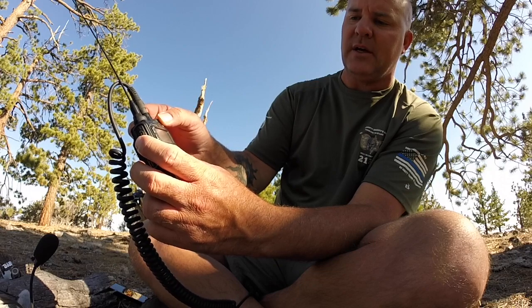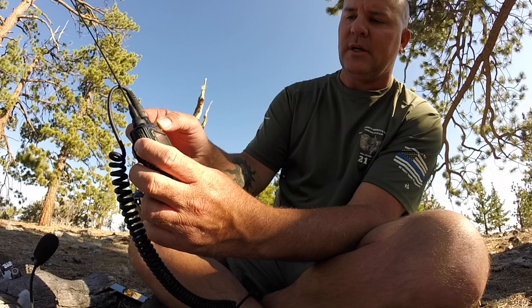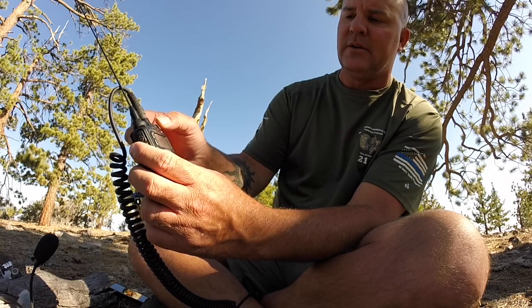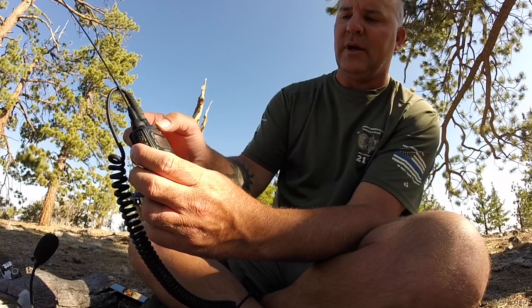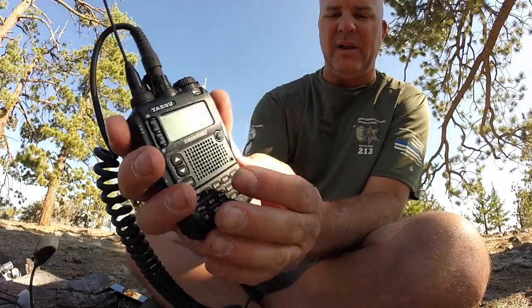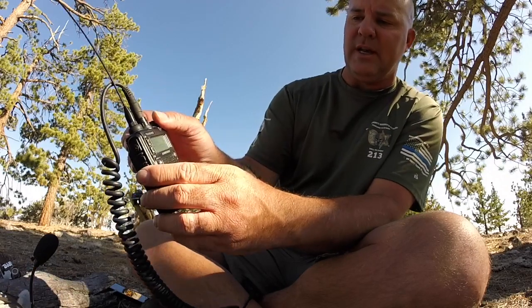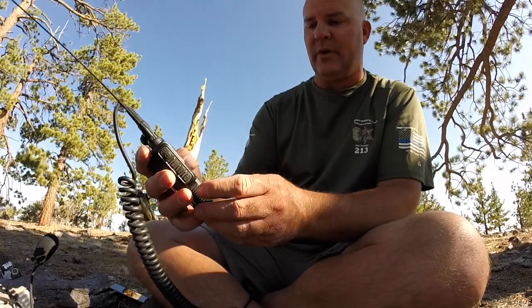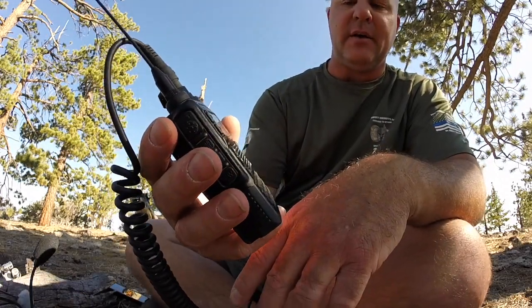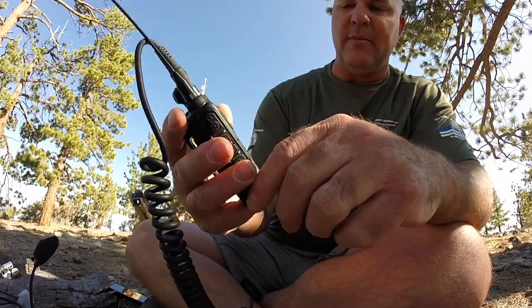Whiskey Six stroke — there's a forward slash and a backslash, I just know which way it points. I'm rotating the dial and it scrolls through all the lowercase, all the uppercase, scrolls through everything. I probably passed it; I'm slowing down a little bit. There we go — stroke. Now because it's on that, I use the dial but I'll have to use Mode to advance to the next spot. Now once it's on the next spot I can hit the alphanumeric key. I got Charlie, and I can go back down here and hit Tango. If I hit zero again I know there's the dash. So CT, hyphen — we're going to call it a dash — and then just keep going. This is two four six, but anytime you hit zero like here I made a mistake. You can go back: push the Band key — Band is like back and Mode is forward — to scroll between where you're at in the message. So now I'm back on 'A'.